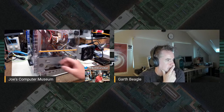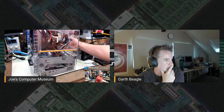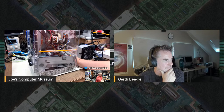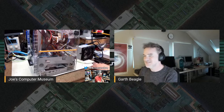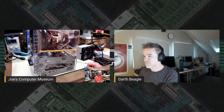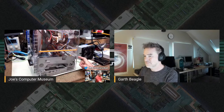If you put it up at the front or something, it's going to look ugly and stupid. If you put it on this back corner back here, you're interfering again with all this physical stuff. The cables could fall into the high voltage analog part and be a problem. So the power comes in here. It loops up like this, loops around, loops over, loops down, and comes back to this side. So we would want to start here.